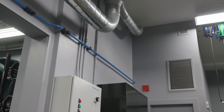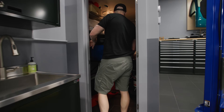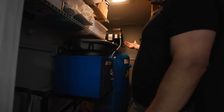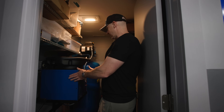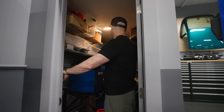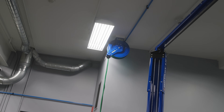This is a Rotary Lift two-post lift — they're doing a lot of engine-out work, not just detailing, so a two-post made a lot of sense. This lift has seen quite a bit of service on some really special projects done here. The compressed air system is fed from Prevost. These were among the very first Prevost systems I had set up and designed. There's a three-horsepower K-series Jenny compressor with an Air-Rv air dryer in the closet — a 125 PSI single-stage low-RPM compressor.